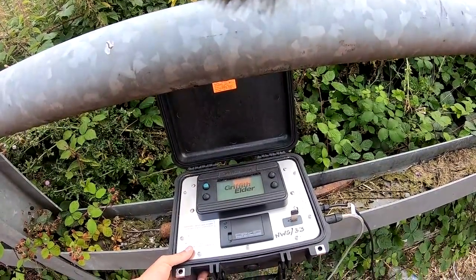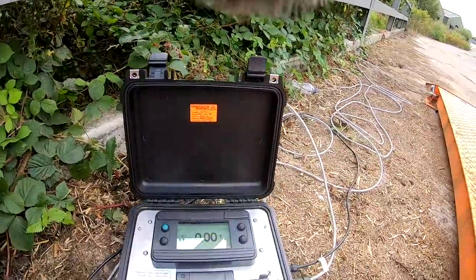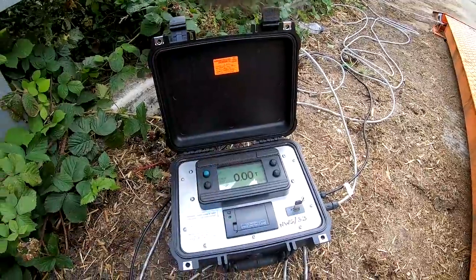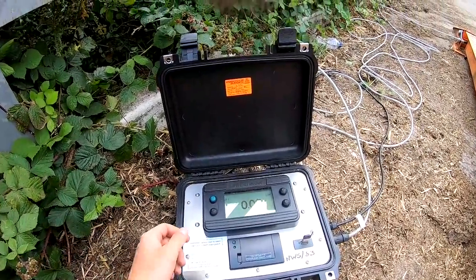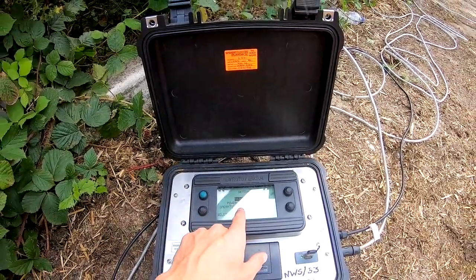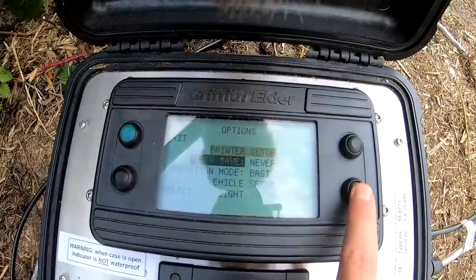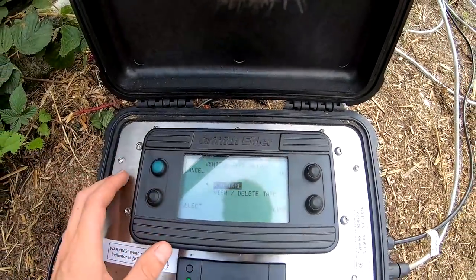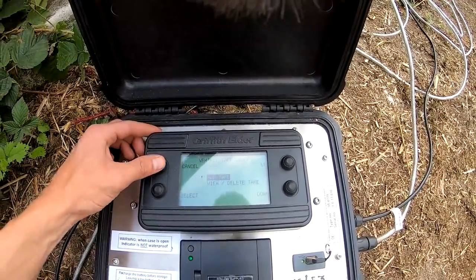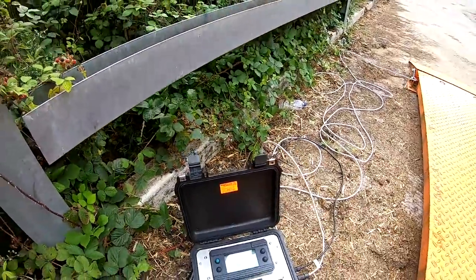Everything's plugged in and the display is showing zero. At the moment it's in manual mode. When we're doing harvest we'll probably use the fob system — little clickers to start the weighbridge up. You'd go into options and set it up, adding your tares. The operation mode is currently set to basic which is fine. In fob mode you'd go to vehicle setup, add a tare, and you need to weigh yourself empty first to enter the tare weight manually. For now we're just on basic mode — we just want to know what things weigh.